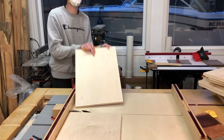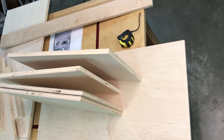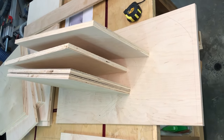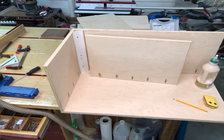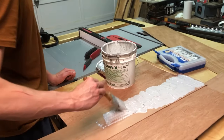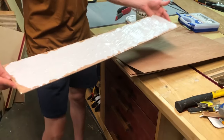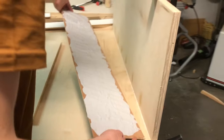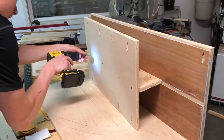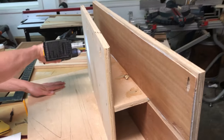It is very important to label all the pieces — one, two, three, four, or A, B, C. It's very confusing when you have 20 pieces that look very similar in size and you're trying to figure out which is which. Make sure you use a square to avoid lots of problems as you build your project. We used some acoustics with a quarter-inch layer of plywood as well, to further reduce vibrations in the cabinet, especially the back wall and the side walls. We also used additional bracing between layers to further reduce vibrations and make a more solid structure altogether.